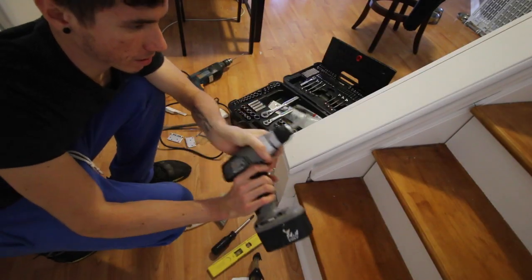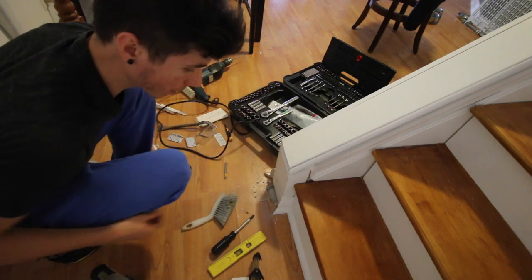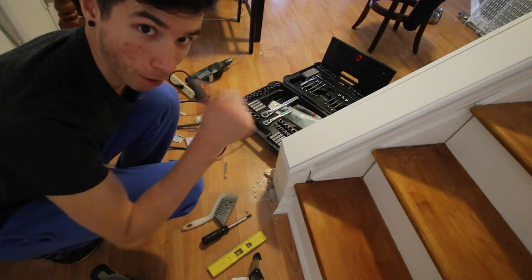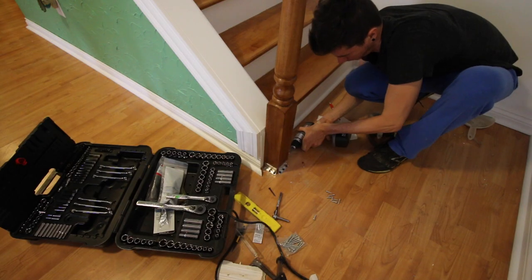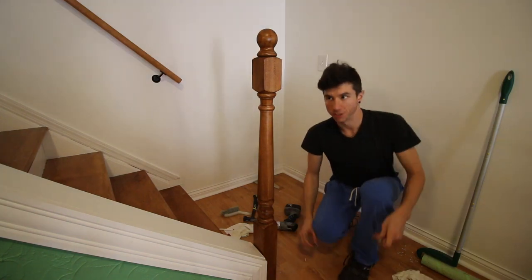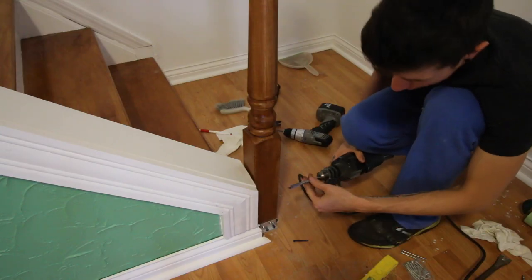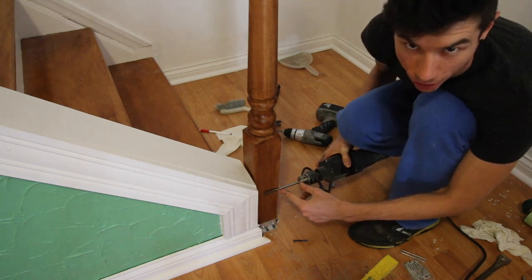I stripped out the bit on the socket driver, which was not good. But I have a neighbor next door who literally has almost every single tool you could think of in his garage, and he doesn't even care if I use it. So — the post still has a small little wobble to it. What I'm going to do is take a half-inch drill bit and countersink a hole for a three-inch screw so it goes directly down and won't move at all. I'll put a little piece of tape on the bit as a depth guide so I know I'm not going to go too far.